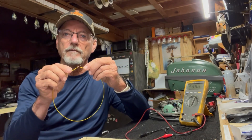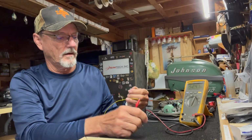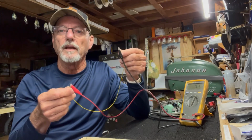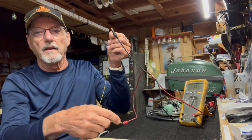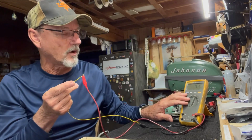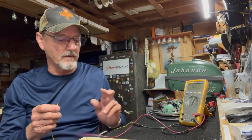A circular path that voltage runs through. All right, so if I take my voltmeter and I put it here and here, what have I done? This was a circular path without the meter on it. When I put the leads on it, it's a circular path. It goes from this lead, the red lead, out, across this lead, back through the black lead. That is a path. So the battery is discharging. It found a circuit, so it's discharging and trying to get an ohmage reading through this thing. 0.4 is what it reads. So that's a circuit. A circuit is a path.